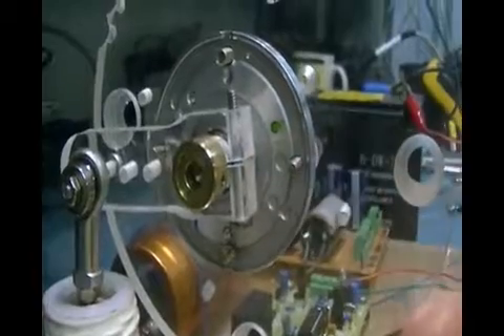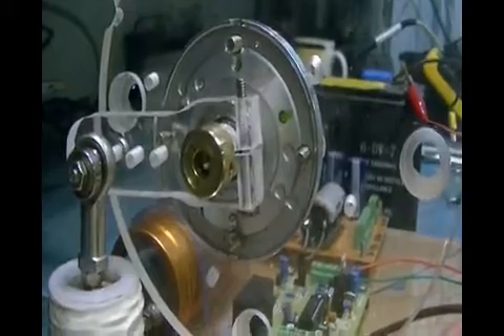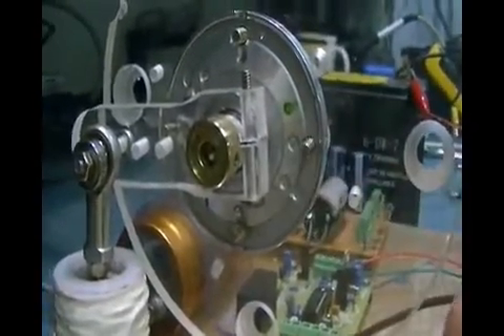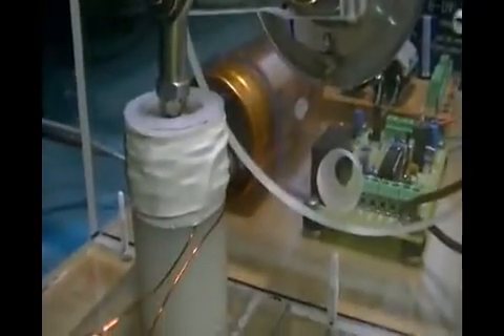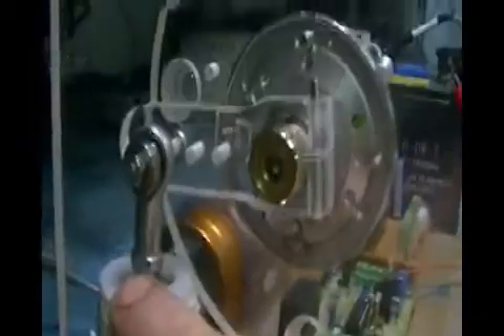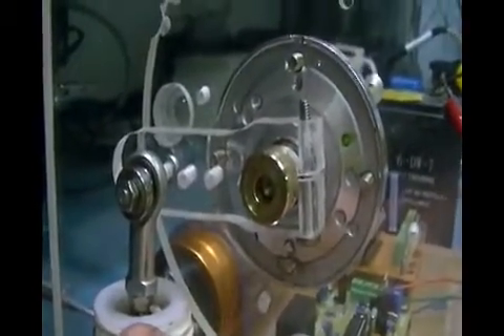You're probably thinking there's no way that's going to turn — but inside the conrod is a magic little part that's very readily available. It can handle up to three to four thousand foot-pounds, which is more than enough. It is called a sprag clutch. This is how the system works, and I've been waiting for something to come along to drive it. This popper engine seems to be exactly what will work right here.